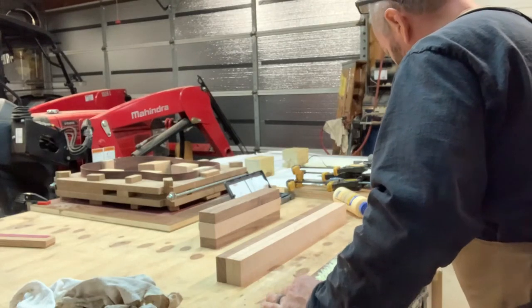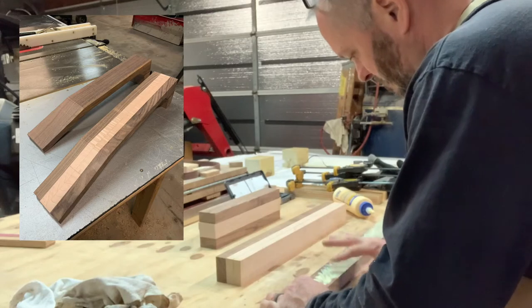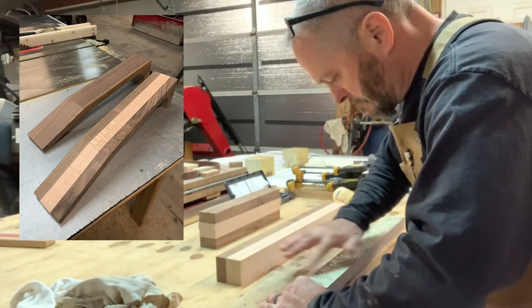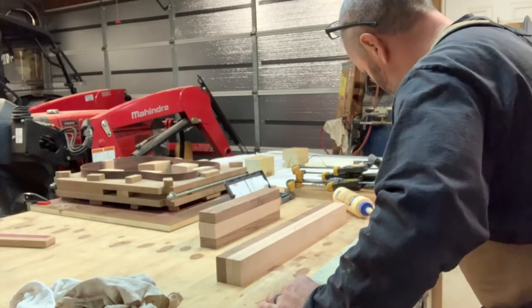What I'm doing here is I'm gluing up exterior portions of this guitar neck in black walnut, the middle portions in maple. I'm just carefully spreading glue on all the surfaces, get these clamped together and blocked together, and we'll start carving after that.